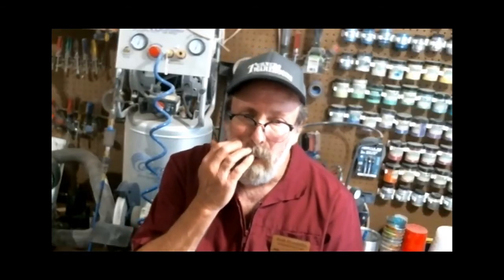If you're going to do a bowl blank or something bigger, then I would suggest you go to Alumilite Clear Slow. The reason being is you have a longer work time, for one, and it doesn't set as fast. It takes longer to set, so you don't have as many problems with heat cracks and stress cracks and things like that that can happen. When this resin, any kind of resin, is curing, it has a heat transfer, and it gets extremely hot. This will get up to about 240 degrees while it's curing. With a bigger cast, the more the mass, the hotter it gets. And when it's starting to cool, the more prone it is to cracking.